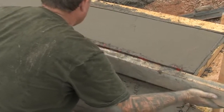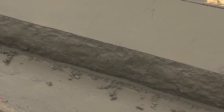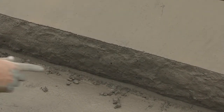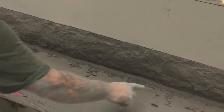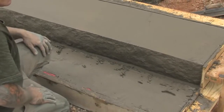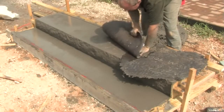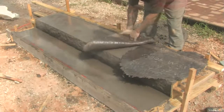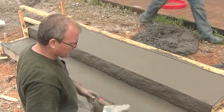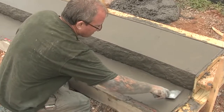And we've got that beautiful stone-like rock edge that looks really nice. We did a decent job of vibrating it — we have just a few minor little voids, but nothing unacceptable. I'm going to get a hand float to get in here and address this area, and from here you could either leave it slicked out or texture it to make it look like rock. Now that we've floated out the little depressed area from the step liner, I like to use a duckbill trowel to come in and really finish this area off nice.